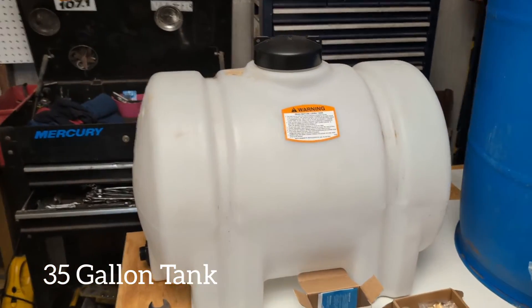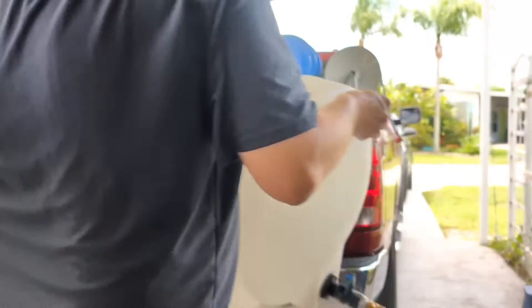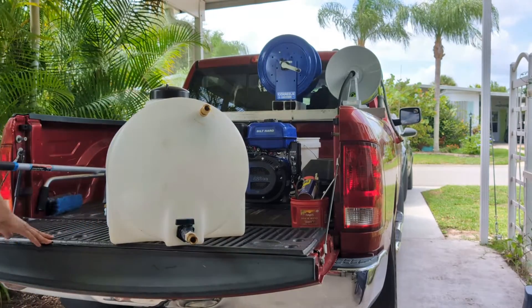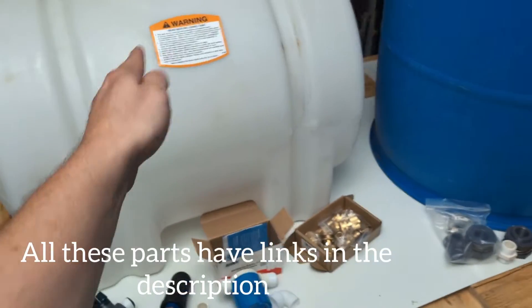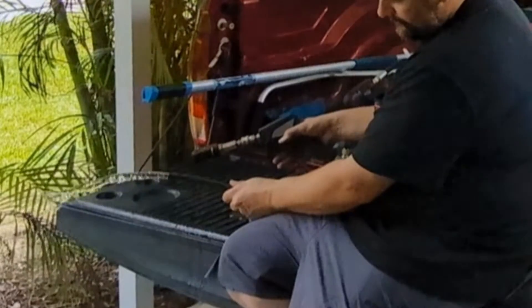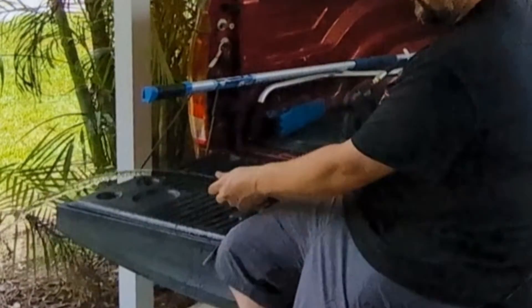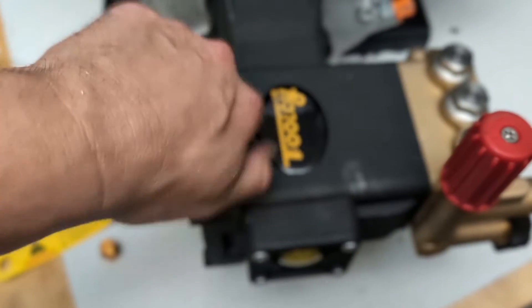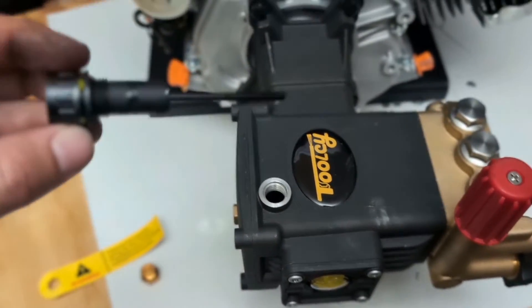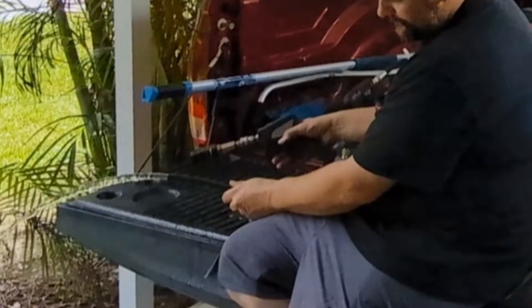I have links to this tank in the description and you can have it shipped right to your house. Before we dig in, I have to explain a few things so you get the basic knowledge of why we're even doing this. This valve allows you to have the option to dump water back into a tank to keep your pump cool. Every time you're pressure washing and you let off the trigger — even for five minutes, setting the gun down, talking to a customer, answering a phone call — the pump's running the whole time. That water is circulating and getting hotter and hotter until it's too late and you've done serious damage to the seals in your pump. What that valve does is keep your pump cool at all times — when you lock the trigger, water is constantly circulating back into the buffer tank.